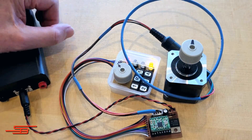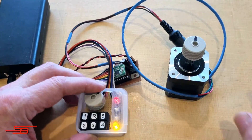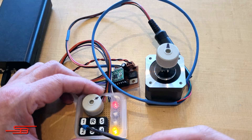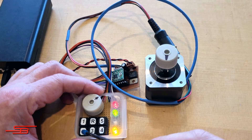Switch-on state 3 is currently saved on this board. The green LED flashes 3 times. That means: speed 1 is controlled via the potentiometer, speed 2 is loaded from the EEPROM, and the short distance button 4 is set to 2 turns, which corresponds to 1mm on the lathe.